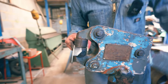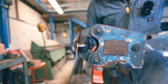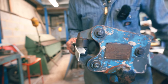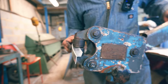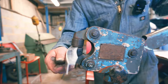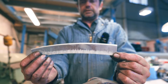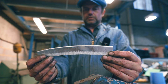So we're shrinking this edge, which will allow this to turn up, won't it? I think these jaws are very, very warm. And it's done now, but I'm actually standing on a rocky bit of ground. There we are. So we've got proper Eckold shrinker marks that we'd expect to see. And we've come off straight, haven't we? We've now got a nice curve in it. We're now following the fuselage or our airframe, aren't we? Or whatever we're trying to do.